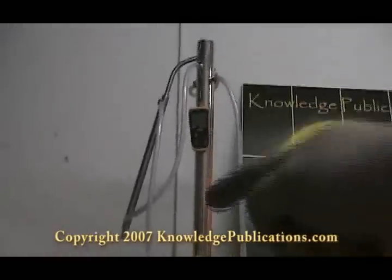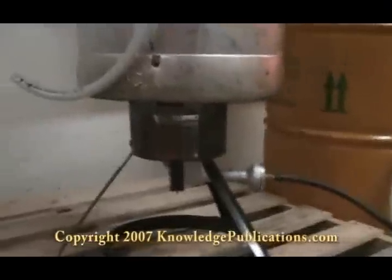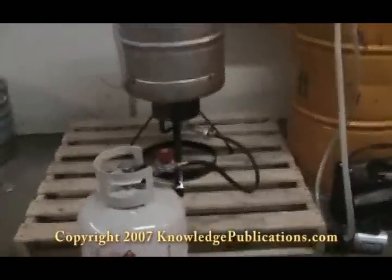Here's what we did. This over here is an alcohol distillation column, and it is on nothing more than a simple 15-gallon beer keg, which my employees thankfully emptied. Underneath of this is a turkey frying oil burner, the type of thing you cook your turkey in around Thanksgiving, full of oil — got this at the hardware sporting goods store. We fired this example off of propane, but you could have easily fired yours off of wood or any other heat source. The barrel over here was for nothing more than cooling water, just circulating through the lines and then going back in.